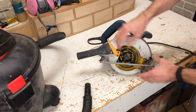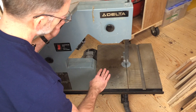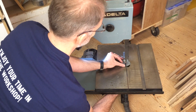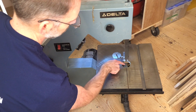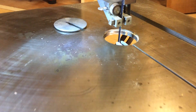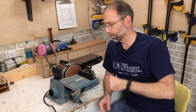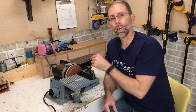There's still some dust that comes out here, but this certainly catches a lot when I use it. For my old bandsaw, I didn't have a dust port, so what I ended up doing was taking a vacuum accessory and putting it on either side of the blade under the saw, then hooking up the shop vac. The dust is captured right at the blade when the cut's made. Here's another example of a tool that has a dust port — this is a disc sander and belt sander, and it helps manage the dust when you're using the tool.